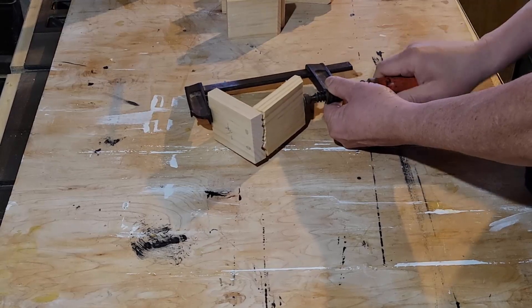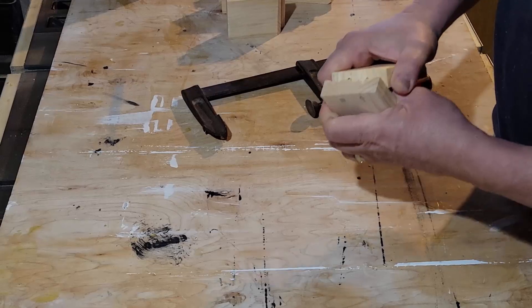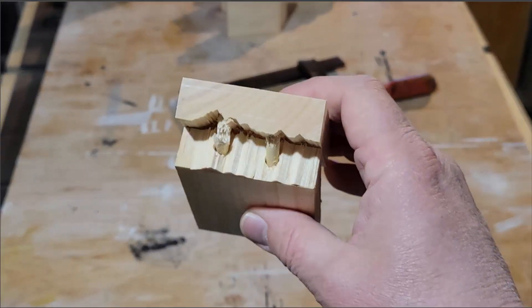This is the quarter-inch and as you can see the joint is not breaking — it's the wood — and this is really hard to get apart. It's quite sloppy and easy to fit together with tons of glue in there, but as you can see it has set up really nicely and is a very strong joint. The problem is there's no resistance when putting it together; it just slides through, so it's probably not the best for supporting the setup while everything cures.